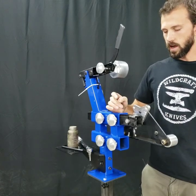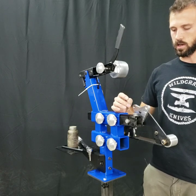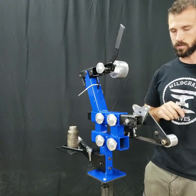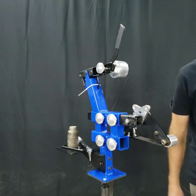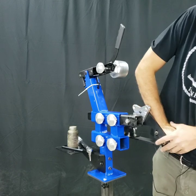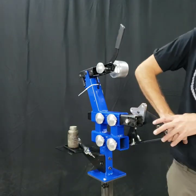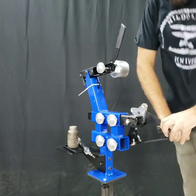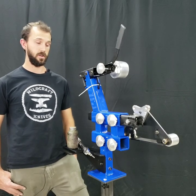If your threads have dried out, send it with a little bit of oil or try a little bit of anti-seize or some sort of lubricant on the threads and on the washer under the head of the bolt. And you should get a significantly higher level of clamping force. Thanks for watching — I hope you found that helpful or at least interesting.